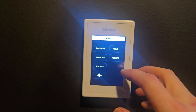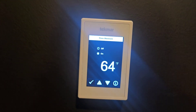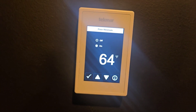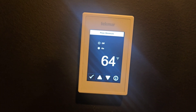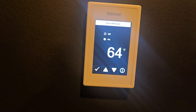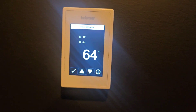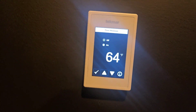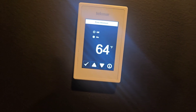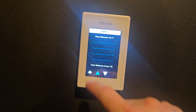You really don't want that. That's the beauty of the floor minimum: you set it a few degrees below your set temp. Some of that is experimental — it depends on how efficient your piping was done and your insulation level, so it may not be a few degrees; it might be 10 degrees or just two. In my case I have it set to 64, so I never let the slab drop below 64°F. Even if the sun heats the room to 71, the boiler may still kick on just to maintain the slab temp so that when the sun goes down and the room cools off, the slab is ready to react.